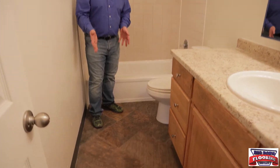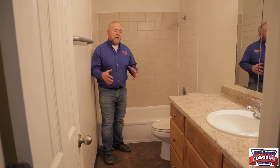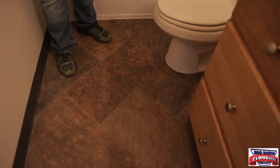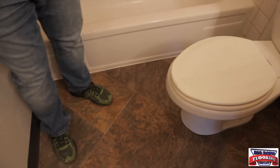Here we are in the bathroom. This particular one is matching the kitchen, though it doesn't always work that way — sometimes landlords don't match them. Generally, matching matters only if the spaces are touching each other. In the bathroom, vinyl is great because water on the vinyl has no cracks or seams. You also want to seal along the tub and wall base with silicone to prevent water going underneath. Vinyl flooring is the best product to use in the bathroom.